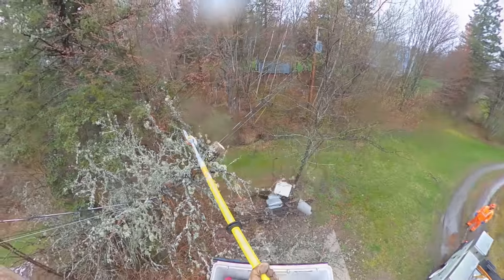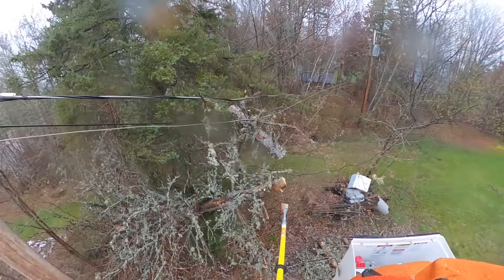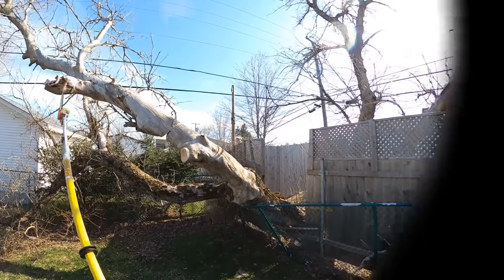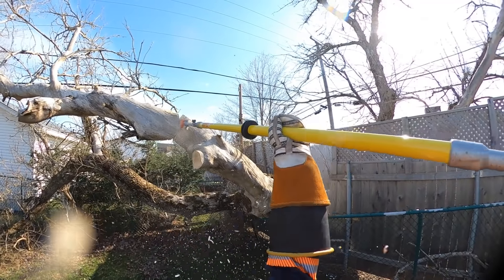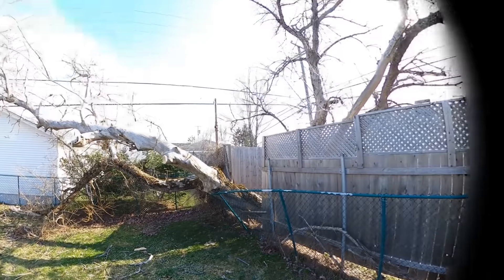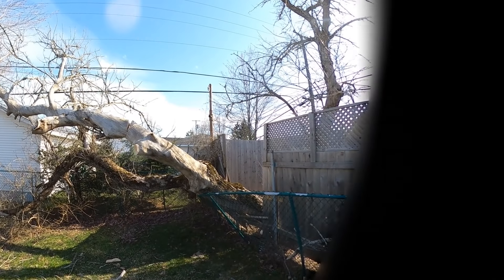At the same time, us linemen, when we do cut trees, we're not out there clear cutting — usually there's just one or two trees involved. With a lot of back lot construction, it's not always convenient to carry multiple saws along with all your rigging in isolated areas. So I did want to try tackling an entire tree with this pole saw. One opportunity had a tree butt about 22 inches — big enough that the 12-inch blade wouldn't cut it, so I had to attack it from both sides, and it worked really well. As long as you let the blade do the cutting and don't force it, there's no issue. I'm confident moving forward I'm not going to lug two or three different chainsaws. For the final cuts at the butt of the tree, it's actually nice to make that final cut without having that blade right there in front of your face.